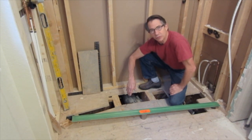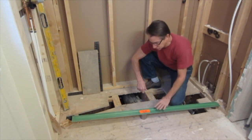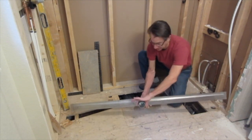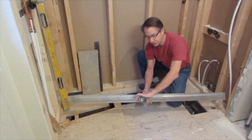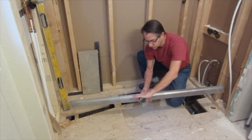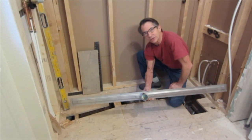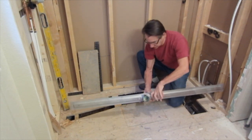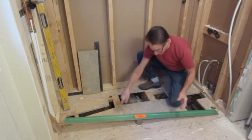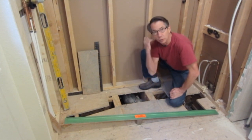I prefer the shower line — it's much easier to work with the PVC drain. You screw it down into the subfloor. It's a much easier installation than the stainless drain. The other advantage with this drain is that they have offset the downside flange. This is a 57-inch and it's offset also. The 63 and 68-inch drains are in the center. But if you have a joist that's going to be in your way, you have the opportunity of turning the drain around, moving it so that you're not interfering with your floor joists.